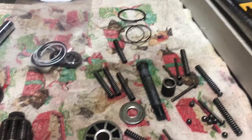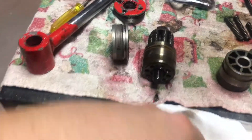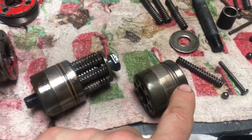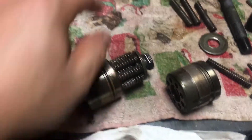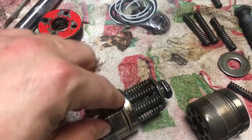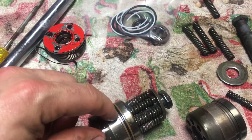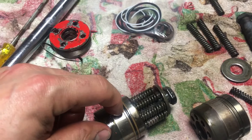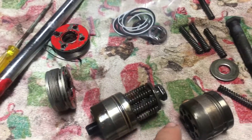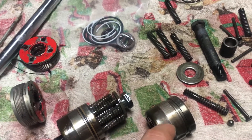Some versions have an o-ring here to avoid leak-down — not sure if I'm going to use them yet, I have to double check. My seal is completely fell apart, but that's what they look like. There's a white seal that goes around right there, and a rubber seal — which is Viton or Buna — in the middle, and two on the outside.